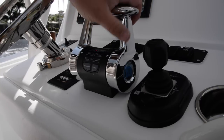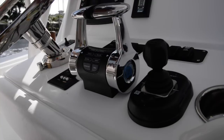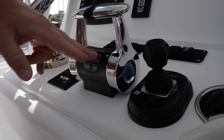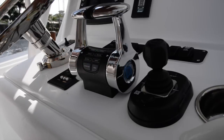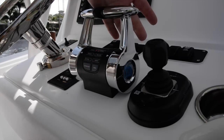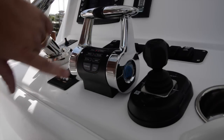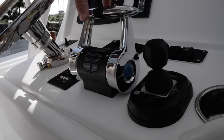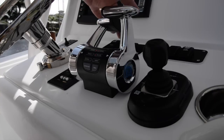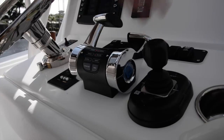They naturally both control the left and right engines. However, they do have a nice one-lever mode. The way you activate it is interesting — you put them both into gear while the boat's underway, select the mode switch, and when you get to one-lever mode you press and hold the control button until it flashes. That's telling you to pick which lever you want to use, and the next lever you push forward will control both throttles.